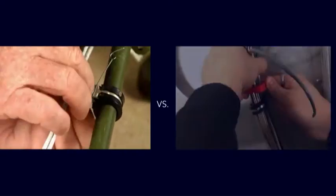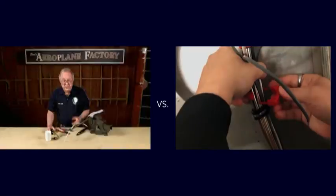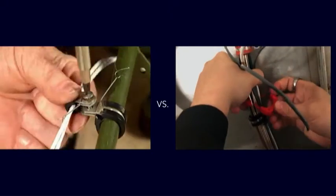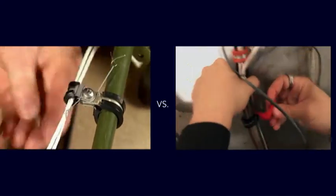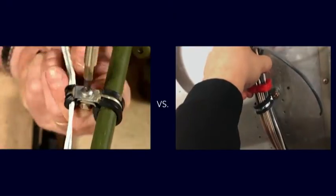So, in reality, we want to take these clamps, which are outdated from the 1940s or even earlier, as you can tell from this very sped up video that requires a lot of additional tools and time, to this, a thermoplastic clamp that acts like a buckle. It is non-corrosive, non-conductive, eliminating the risk of electrical shorts, and it has a sensing mechanism inside of it that can measure amperage leaks, electromagnetic interference, changes in temperature, humidity, radiation, sonic weapons, among others. The reason for sonic and radiation is because it also has applications in fiber optics, where those are the things that will disrupt the wave through the fiber optics.